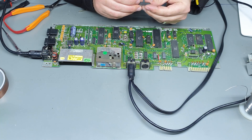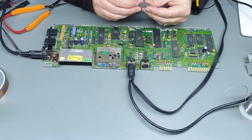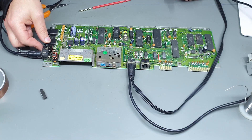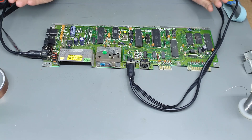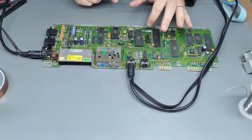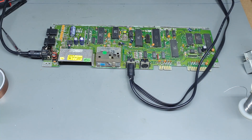The writing has pretty much disappeared off this chip even before I heated it up. I think it's a Sanyo chip but that is literally all I can tell you. Let's see what happens. Still a white cursor. I guess at least I know this chip is still good, so I'll put that back in. From looking at the pictorial fault guide the colour RAM looked very similar to the issue I was having, but obviously it's not the colour RAM unless it's a damaged trace nearby — I'm starting to move away from the colour RAM.